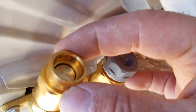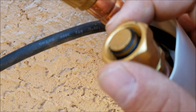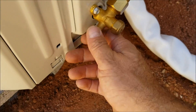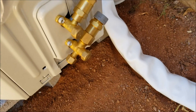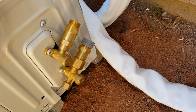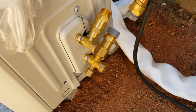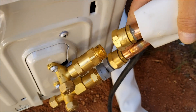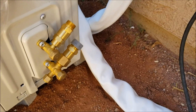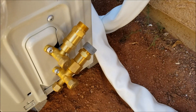There's also a port here that if you did want to pump it down, you could. But these are set up so that you don't have to pump them down. A lot of people might get confused with that, especially if you've installed mini splits before — that's why you don't need a vacuum pump or gauges to hook this up. Right now I'm going to screw these fittings on and get them tight using the two included crescent wrenches, then get started on the wiring underneath.